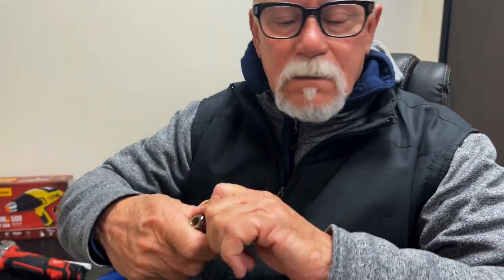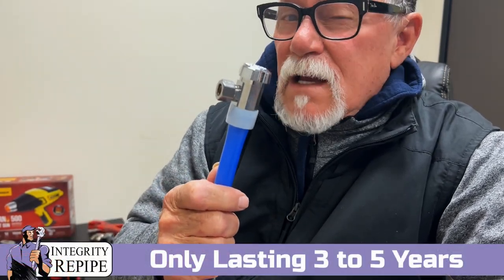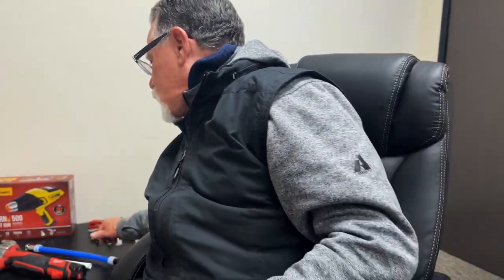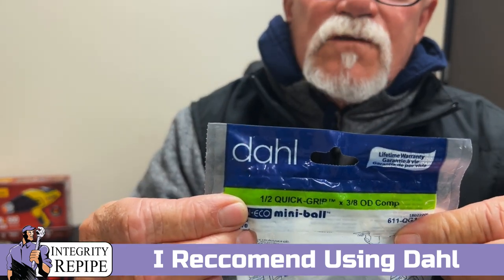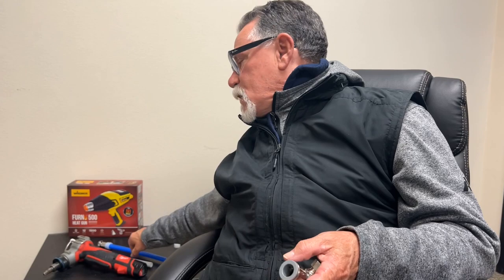In the Southern California area, these Brass Craft valves are lasting in the three-to-five-year range before they start failing inside a house. The up-and-over valves last about two years, and you'll spend close to seventeen hundred bucks a house replacing them all within two years after installation — they're just total crap. What I actually recommend is called Dahl — D-A-H-L. They're expensive, but that's what I actually use.